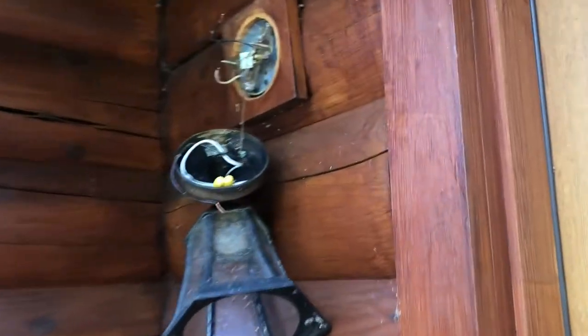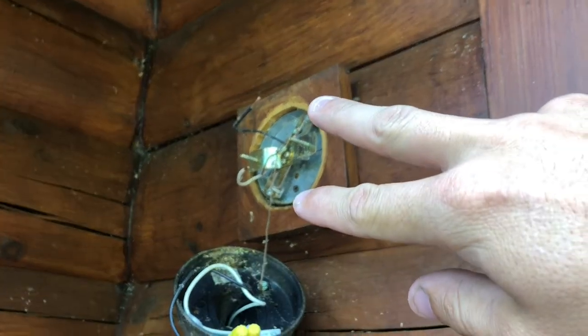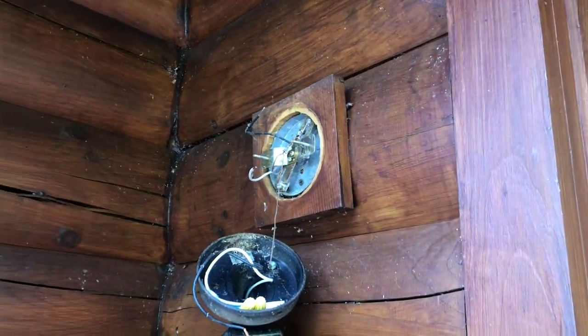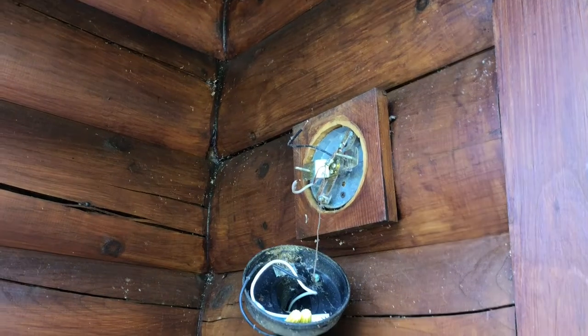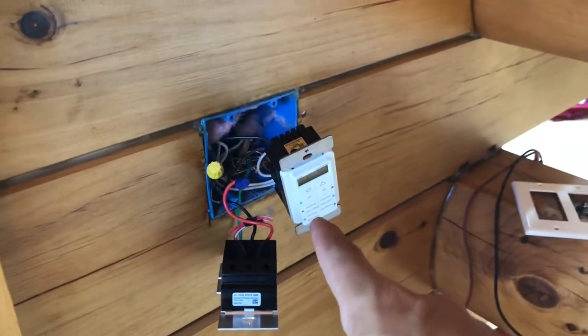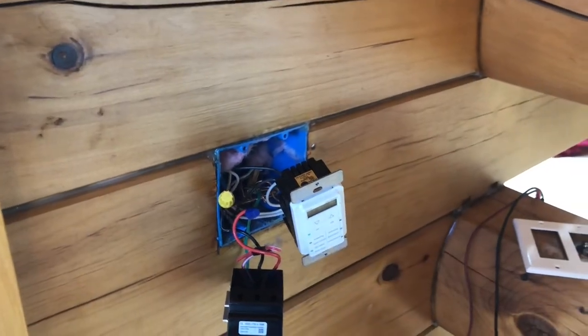Rambo's hanging out here. So I've taken the light off and I have the wires hanging out. I was measuring power out here and it turns out I only had about 60 volts coming into the wires. When I checked over at the switch, I was getting 120 volts coming out of there, but I was not getting 120 volts outside.